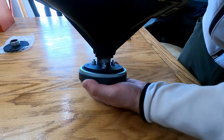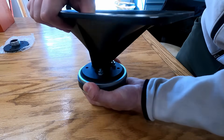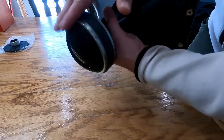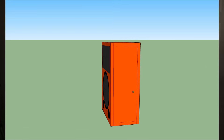Designing the box seems like it's going to be easy, but it's actually a little more complicated because you've got a lot of things going on. The depth is one consideration — we want to keep this as skinny as possible. Typically the woofer determines cabinet depth, but on this build it's actually the compression driver along with the waveguide, which is just over seven inches, meaning the box needs to be about eight inches deep. Once I figured out a port size that worked well with port resonance and wouldn't have a problem with chuffing, that ended up being a 20 by 14 by 8 box. Now that I know it's going to fit perfectly, we better go ahead and build it.